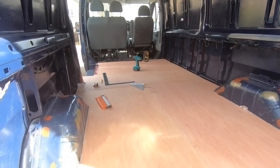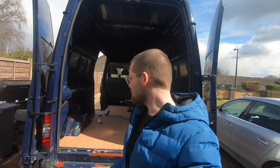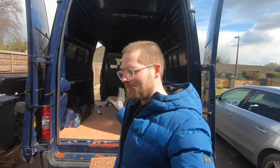So there we go, that is the subfloor finished. Right now it's held down with screws that are too long — I don't have the right screws — they're just there to pin it in place so as I measured the next piece, the piece before didn't move and ruin everything. Everything's pinned down. I just need to get the right screws and we're going to leave the floor for a while until we come to finishing things. I don't want to put a nice floor on top of this — it's probably just going to be lino — but I don't want to be cutting holes in the roof or doing other messy jobs and ruining the floor. I'm quite happy. There are definitely bits where you can tell I've never done this before — jagged lines, not particularly well cut — but it's going to be covered with the nice floor and I've learnt a lot. I've never used a jigsaw or a circular saw before, so I'm quite happy.